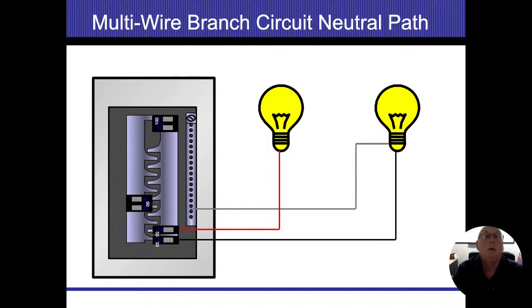All right. So when I have these two breakers right next to each other, even though they're both on the right side, just because it is a staggered bus bar, the bottom breaker is taking its electricity off the left side. The second from the bottom breaker, or the one where the red line goes to it, is taking its power off the right side. So they're both opposite phases. One's getting when it's positive, the other one's negative. So now we energize that on the opposite phase.